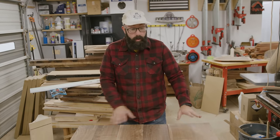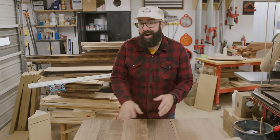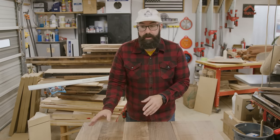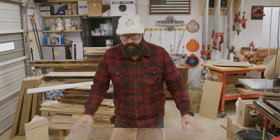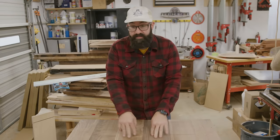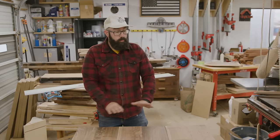I wanted to have 6 6-inch boards, right? But this one board was the odd 7th board that I used to cover just in case I had something turn into a taco, and it was a little narrower than I want. So we ended up going 5.5, 6, and 6.5, and that gets us our 36 inches. So I've got that laid out, we're ready to go.